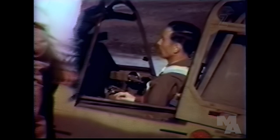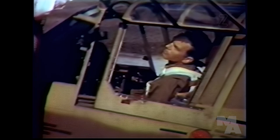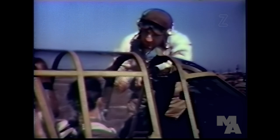If you ever happen to end up with the airplane on its back and the cabin closed, you can open the kick-out panel in the left-hand side of the sliding hood by means of this red lever near the longeron. There's another emergency exit you can use during flight. Up here in the top of the cabin roof is a red lever. Simply pull this lever and it'll release the whole cabin.